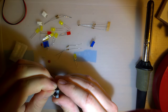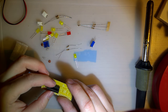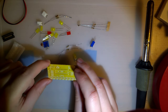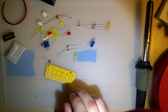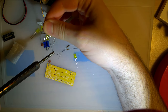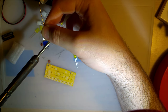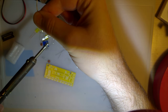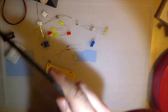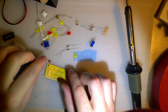I'm going to pull this socket out of the foam and try to straighten out some of the pins because they got bent in transit. We should probably start with the low-profile stuff. When soldering, you've got to think about what you're doing a few steps in advance — make sure you're not making it more difficult than it needs to be. I'm going to use the same solder I've been using. It looks like the iron is just about warmed up, so let me get that tip tinned.